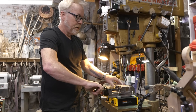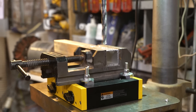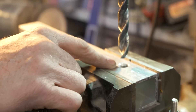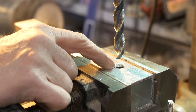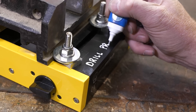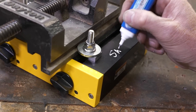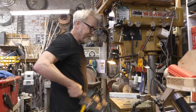Now we simply clamp it in. Come on over here and take a look. You'll just notice in close-up that it isn't a pretty hole, and it's not a pretty hole because this is too much drill bit for a single hole — you want to creep up on this. If you want a really nicely finished hole, you should be going to the next size down and then finishing, maybe even with a reamer. But the finish of this hole isn't what's important — what's important is it's a safe hole. And this MagSwitch vice attachment just lowers the threshold to entry to safe operation.